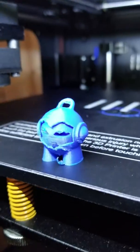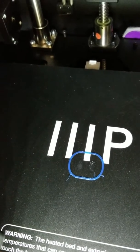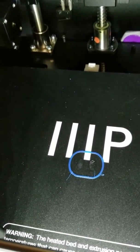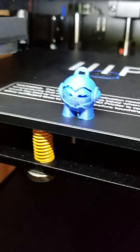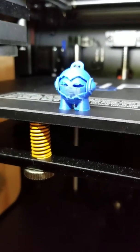If you can see the skirt, the skirt made a little bit of a mess going down, implying there was some oozing or dripping coming out prior to even beginning to make the part. So there are definitely some tweaks to be made. I'm using the retraction speed and distance settings suggested in the manual, although I may try increasing those a bit. This filament is Monoprice PLA Plus at 205°C extruder and 55°C on the bed.